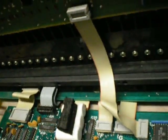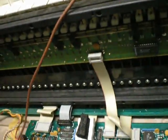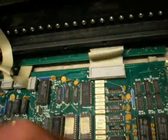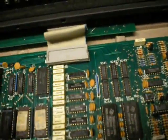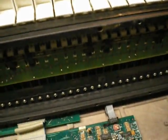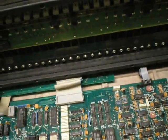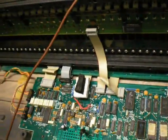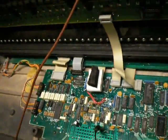That's measuring off that second pin instead. It goes from test point 8 to there. And so coming out of the buffer here on pin one, you'll see another pattern, which is the DAC's buffered output. And so that is all of the signals being fed to the sample and hold cells, fed through these 4051 chips and onto the sample and hold cells in these quad op amps with these capacitors — which feeds the actual analog circuitry. You can look at my POLY6 video for a more detailed explanation. That's kind of the way the computer works in this thing. The DAC in this one is the 0832.